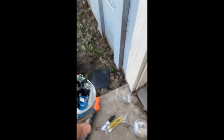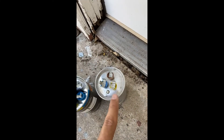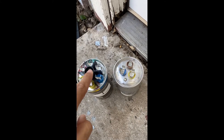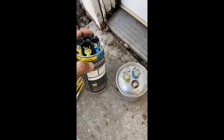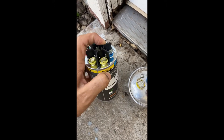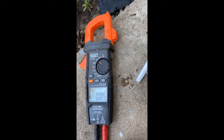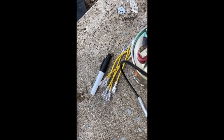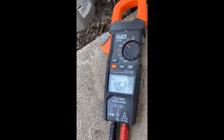To make up the 45/5 rating we need, we start with the common in the center. We want to make up the five for the fan side — there's a five tap and a two-five tap here. The brochure for this particular model says to use the lower number. Testing common to fan gave nothing, but common to the five or four microfarad tap gives us a reading.